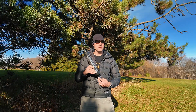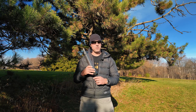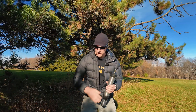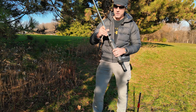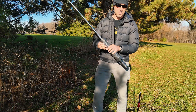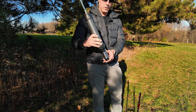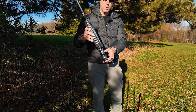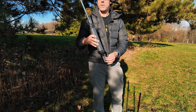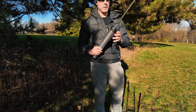I haven't done the test on it yet, so we'll see if it's possible to tune it. We'll see what SWR we can get out of it and the performance of the antenna in general. Once we install it on the base ground with the radials, we'll use the loading coil to tune it up and test it with the Rig Expert A50 to see what we can get out of it.